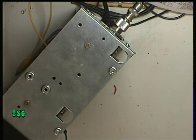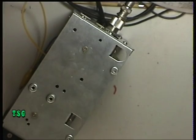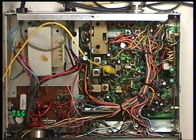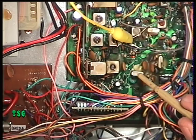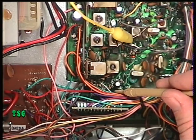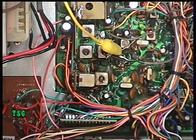It's showing 10.239 MHz — slightly low, which is what you'd expect after a number of years. Let's see if we can get that up. Yes — and there we have it: 10.240. That's brought it up. The 10.24 crystal is there, the trimmer capacitor is there. I put the test probe on pin 4 of the MC145156 — I did it from the other side because I couldn't get to it easily with the sub-board in the way — and I've brought it onto frequency: 10.24.